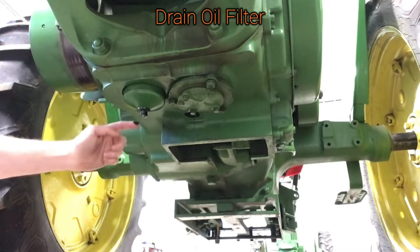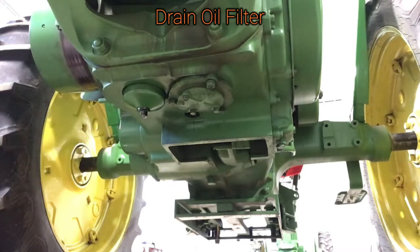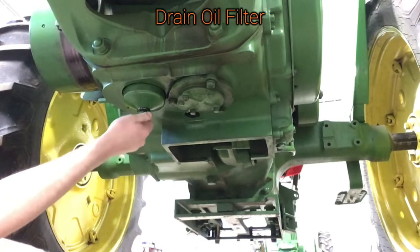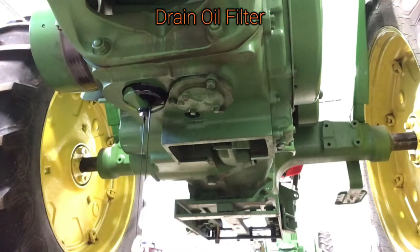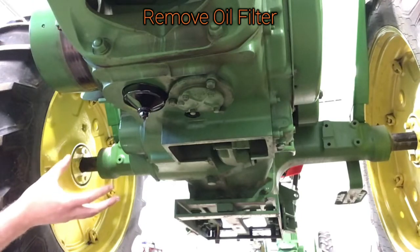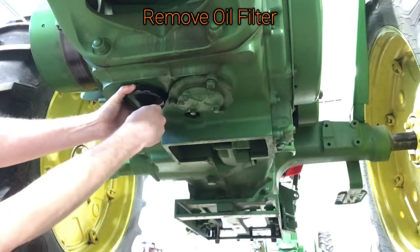You can see I've got a little bit of a leak right here — it's dripping. The reason it's doing that is there's a copper washer right here that, after a couple years of oil changes, gets damaged and frail. I believe I've got another one, so I'm going to replace that and show you how. To remove the oil filter, we're just going to loosen this nut right here, crack it open — you'll see oil start to come out the top. Let that drain, then remove the bolt and pull it out. Make sure you've got a hold of it because if you drop it, pieces are going to fly everywhere and it's difficult to get back together.